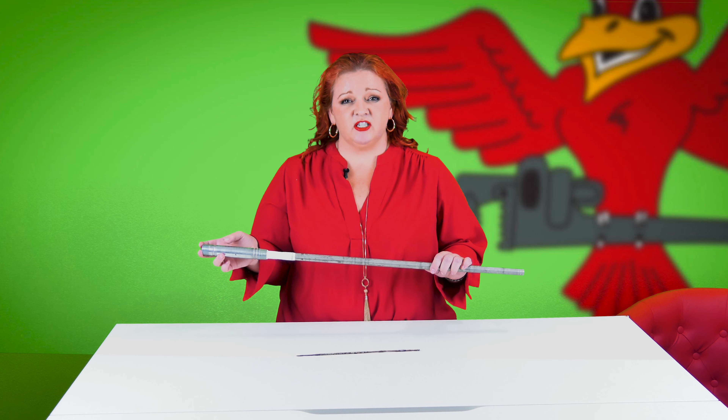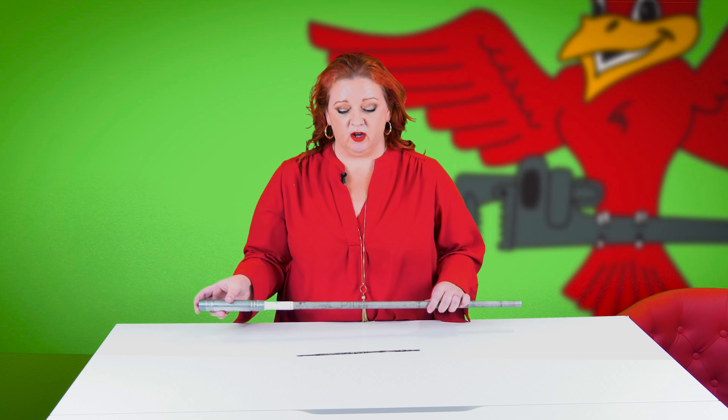In 24 years of doing this, I've seen it myself — water heaters on salt systems have the anode rod disappear much quicker than with just hard water. So if you love your salt system and you have a tank-style water heater, you want to have this looked at every single year when you're having your water heater flushed, and possibly have it changed out — sometimes as often as annually, though you may get away with every two years. Your plumber should definitely be looking at the health of your anode rod.